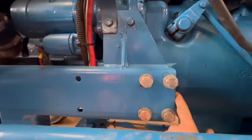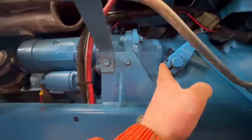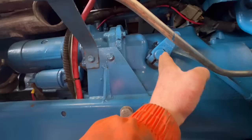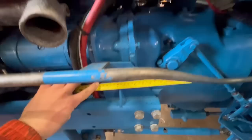And it's supposed to be from the back face of the flywheel to cover the flywheel and all the clutch and everything. So the plate will be from there to about here somewhere. That's a cross shaft, so obviously the clutch doesn't come any further than what the cross shaft is. So the plates will be about 250mm. Make them 250mm, and then I can still keep the original mount for the battery tray,